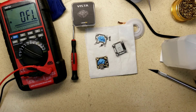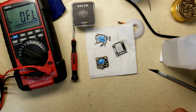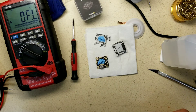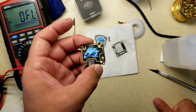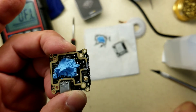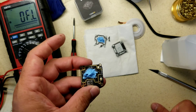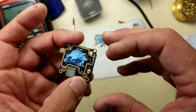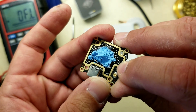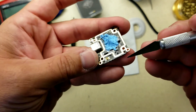Now what I'll do is test this by hooking up a wire set to a standard flight controller on 3S or 4S — something real safe and easy to manage — and check that the MSP communication is working properly. I'm also going to look on DigiKey or Mouser to see if I can find these diodes. I think I can, and then just hot-air-station them back on. You can see the two very clear solder pad separations there.